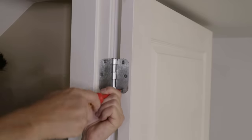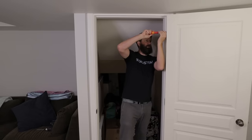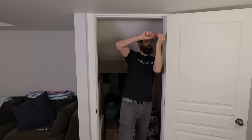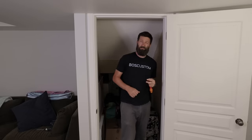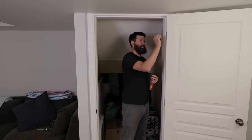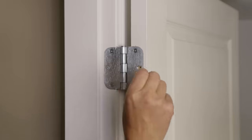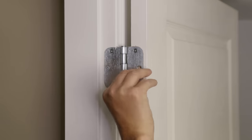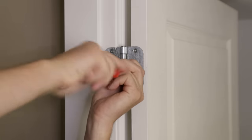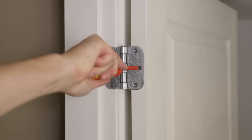Open up the door and see if you can tighten those screws up. That one tightened up pretty good, but this middle one is just spinning. Take the screw all the way out — what ends up happening is if the door takes some abuse and slamming, the screws into the door can get stripped out. Grab a toothpick, stick it in the hole. Depending on how stripped out the screw is, you might need two toothpicks. Stick it in there, break it off, then put the screw back in. Use a hand screwdriver so you don't strip it out even further. That is nice and snug — oftentimes that's going to solve a lot of your door problems.